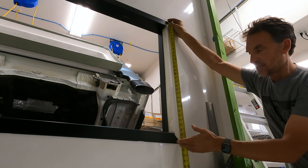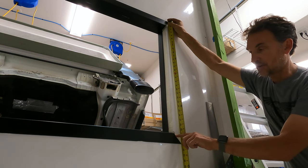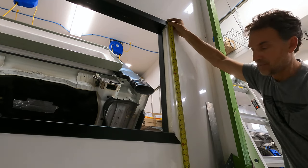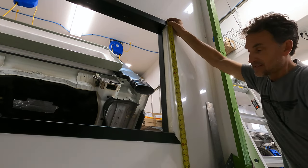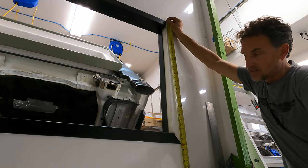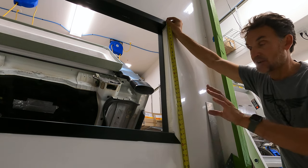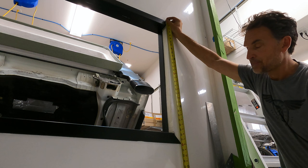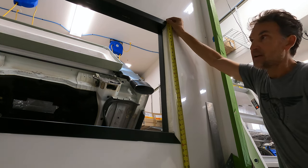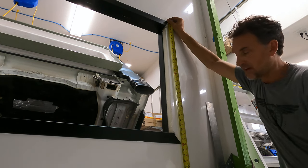So I have to cut it all the way through at this angle, and then I come back in and notch out this, call it squared off corner here. It is a pain. So now I'm paying for it by having to do these extra cuts. It's a lot of extra work, so I almost have to step into it in the final cut there. Being that it's so precise, I want to make sure I've got a good seal. It looks great, but it's also flush and smooth for the seals to rub alongside it and attach to it. And also I don't have these, call it goopy corners or places where water could leak in if the sealant ever broke down.